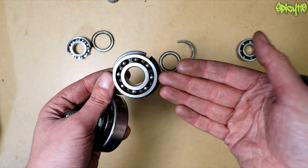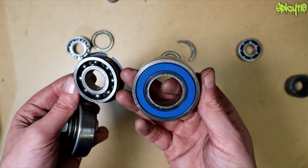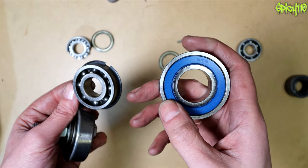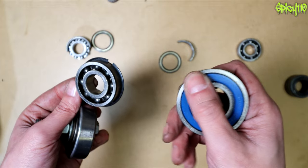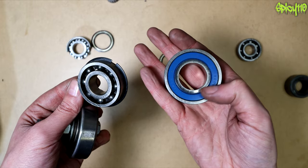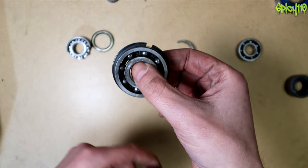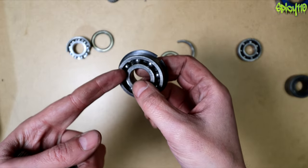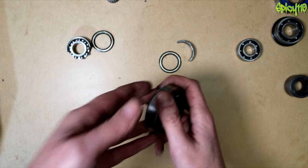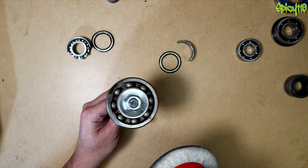This is the most common type of bearing you'll find on a bike — wheel bearings, engine bearings. They're particularly good at high-speed applications and with good lubrication they last a very long time. Ones inside engines are naturally open, while ones exposed to the elements — like wheel bearings or skateboard bearings — tend to be sealed to keep dirt and grit out. Sealed bearings contain a pre-packed quantity of grease and are non-serviceable — you can't take them apart without damaging them.